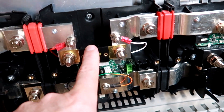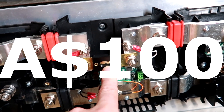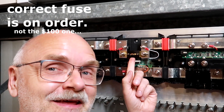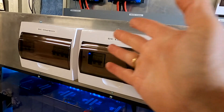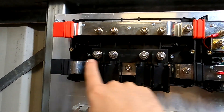The insane part is that the main fuse is not included with the smart shunt — you have to buy a CNN fuse separately, and the original Victron one is around 100 Australian dollars. 100 dollars for a fuse! So I recycled the one we had in Battery 1.0 — it's just a 100-amp ANL fuse. This has exactly the same functionality as the top compartment of our battery shelf. We've got fuse options for all the battery banks, and a DC battery bus system — basically a vertical bus bar going through all the battery bank compartments. Same thing, just far more compact.